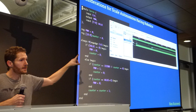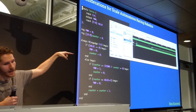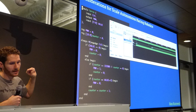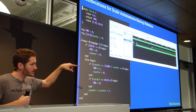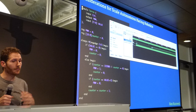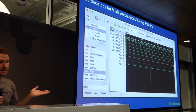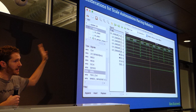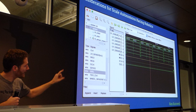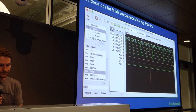The way you debug FPGAs is to look at the output of the stimulus — you stimulate the system by entering a clock and a value, then read back the pulse-width modulation expected at the servo. You can look at the count values to verify the step transitions. This is about as close to debugging as you'll ever get for something happening entirely inside hardware. Showing the lighthouse sensor board, I can stamp out five channels, each showing the flash pulse and then the positioning pulse — entirely simulatable — and I implemented an SPI bus to read data out of the car.